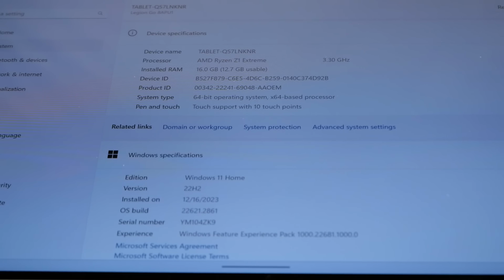But because we have to do that, I can show you exactly what needs to be changed in the SPD data in order to make this work. So that way maybe you can understand what's going on here a little bit better than in the case of the Steam Deck when I just flashed a pre-modified image on. So with that, let me get the board back out. We'll get it on the preheater once again and desolder the system's SPI ROM.